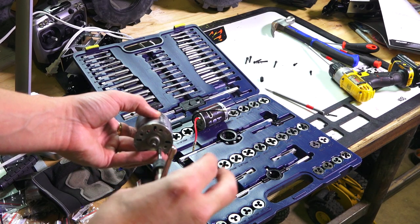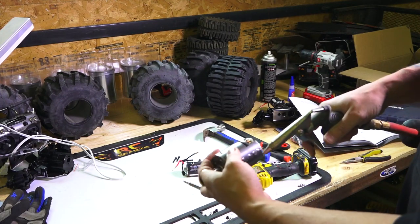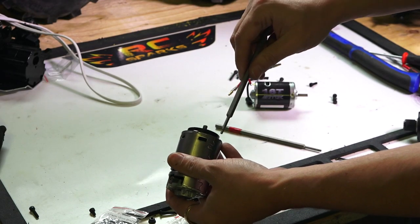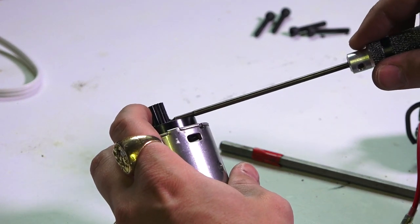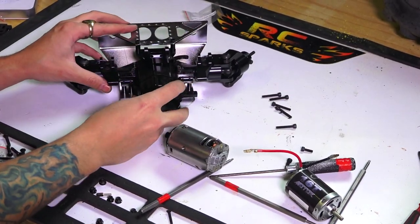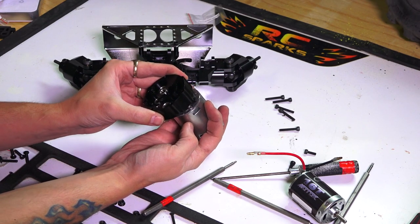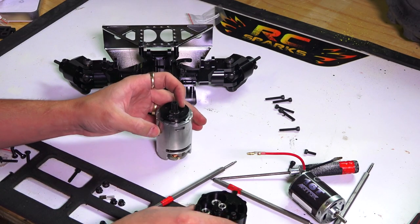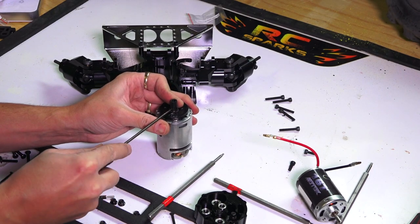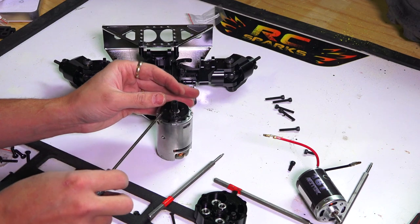I'm just doing the screw threads so I can easily put the screws in there. I'm going to get all those metal shards out, screw it into place, take the pinion and slide it into place. Same thing as I talked about — lining it up to see how it's going to fit. Not bad. And then taking that gear, flipping it back into place, getting a flush pinion. I just need it to move up by about a millimeter. Because I know where it's going and it's going to be here for a while, time for a little bit of Loctite on my set screw — a little bit of red Loctite.